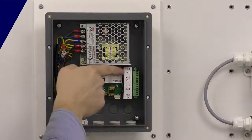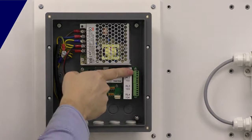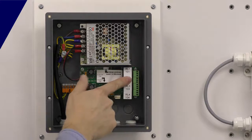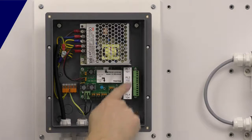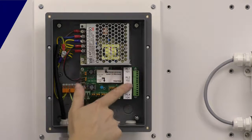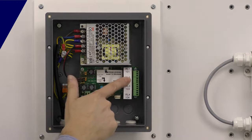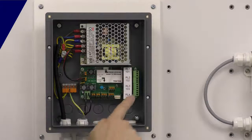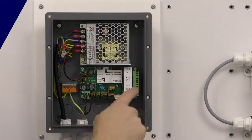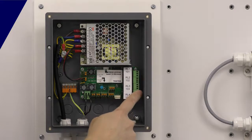If you're going to use these relays: the first one is dedicated to faults, so any system fault this will activate. The second one is any alarm level one. You don't get control over these because we want you always to have at least a fault relay and at least an alarm level one for everything connected to the system. After that, for these relay connections you can do anything you want — these can be any alarm level, it could be another fault, it could be anything you want to make it on the system.